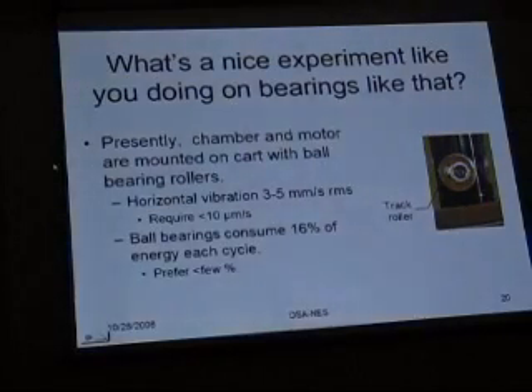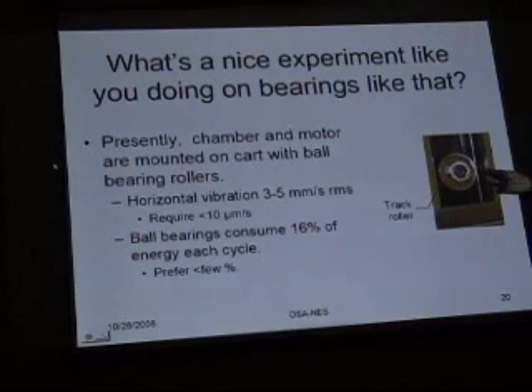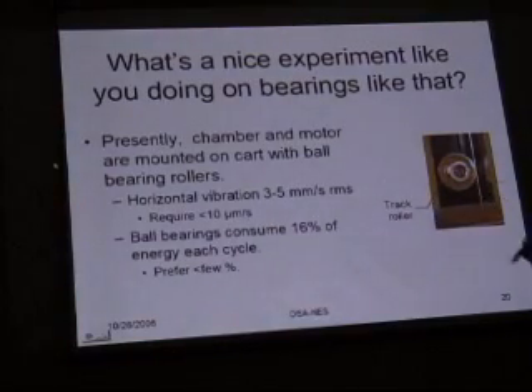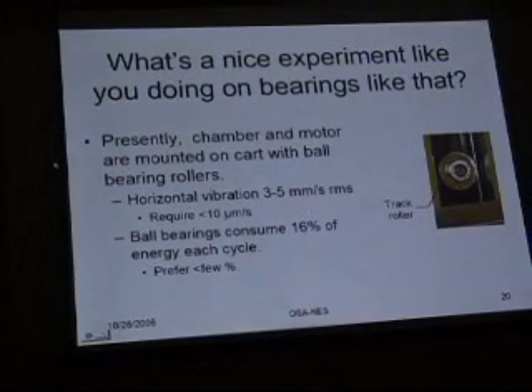The present system runs on these track rollers — they're a lovely compact little thing, about an inch in diameter, with a double race of ball bearings. There's a steel rod it runs on, and a groove in the outside of the outer race — all very compact, very nice, and noisy as anything. Micron-level noise. You can do a little better with ball bearings, but you're not going to get the three orders of magnitude improvement needed. So they're way too noisy — a nice way to get started, but it has to go.